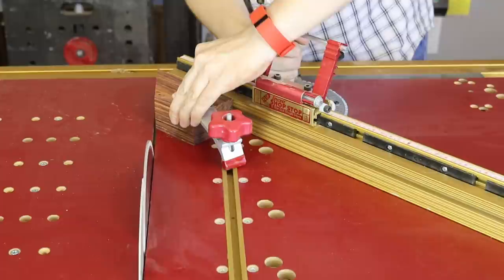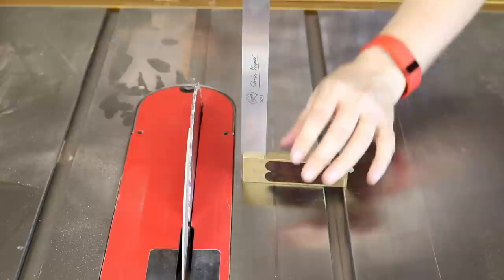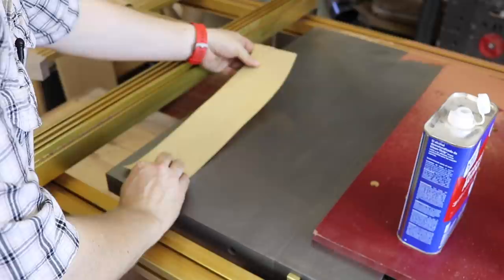Here's where I go a little off the beaten path. I'm going to make a second cut, but first I'm going to make sure that my blade is perfectly 90 degrees square. Combining the band saw with the table saw gets us about 95 percent of the way there. Take a piece off of a roll of self-adhesive sandpaper and put that down on something you know is flat. And then you still want to check this block for square.